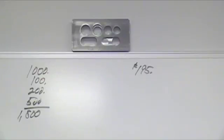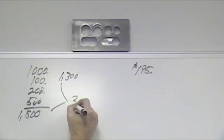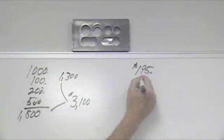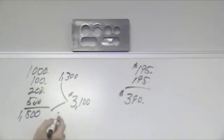All DMC cutters come loaded with inserts. And I'm sure you've got backup inventory just in case of a wreck for at least the cutters, not necessarily the holders. So you have an additional $1,300 for a new total of $3,100. And yes, let's be sure to have a spare DMC cutter as well for $195. And of course you'd have some spare parts over here and you'd have some carbide over here. However, this is a pretty significant difference.